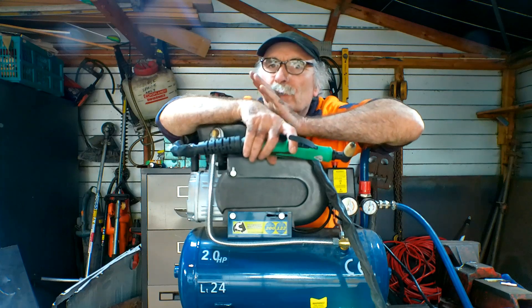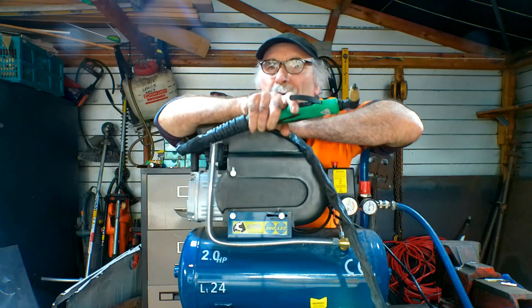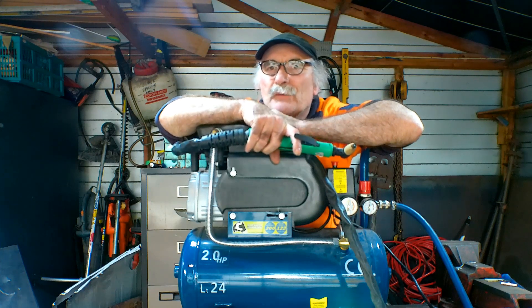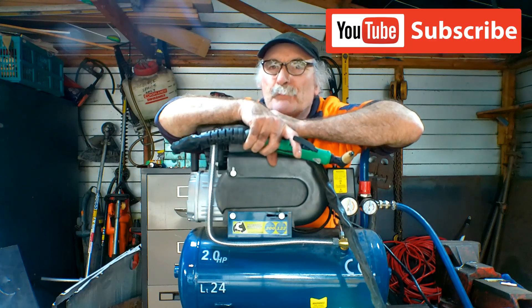So guys, can you plasma cut with a little baby air compressor? Yes you can - if you're only cutting two or three foot strips and not much more than three or four millimetre steel. It'd be ideal for cutting out car panels or doing rust repairs because you're not doing great big long runs. If you're cutting whole sheets or doing two and a half metre lengths this would be way too small. But if you're just doing bits and pieces around the workshop and don't want to spend the money on a big compressor after buying your plasma cutter, try one of these. Anyway guys, like the video, subscribe, come say g'day at peatstools.com. See you next time, bye!